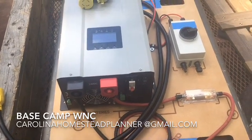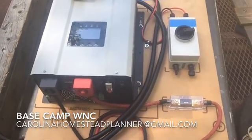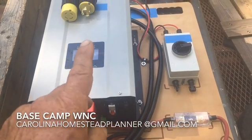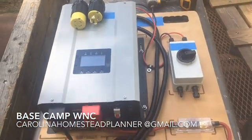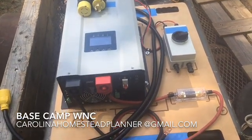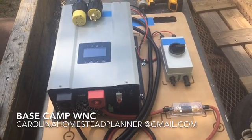If you can't get up to clean the panels off, you can plug this into a generator. The neat thing about this inverter is you can plug a generator right into that AC cord, and it will go straight to the pump. With the 6000 or 12,000-watt units, it goes straight into your power — it does not have to go through the batteries and back out. So in a grid-down situation, bad weather, or snow, you can run it off the generator or just use battery power.